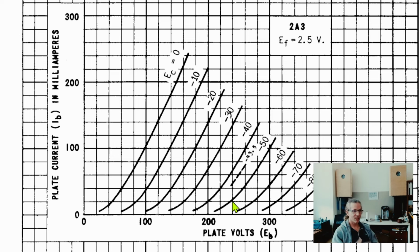It's nothing like what we see in a class B operation, when we have a 20 milliamp quiescent current and then it jumps up to 200 or 300 milliamps. Then we have a 10 times increase. So it is like a 1000% difference versus a 20% difference.